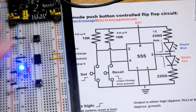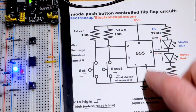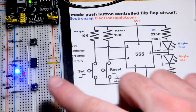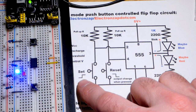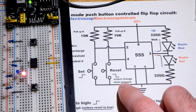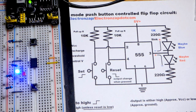In this video we're going to take apart this circuit and rebuild it. It is a bistable mode 555 timer. Some sources call it a flip-flop circuit. Right now the output is low — the blue LED will be on when the output is low. We want to go low to high, so we press the push button that goes to pin 2. The output is holding steady, so it's stable. It's stable in two modes — I have to do something to change the output.